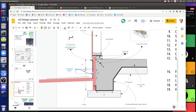We have to dig out a little bit, the easiest way we can, like with a shovel, go take a shovel next to it and dig out without destroying the insulation there. So that's the detail there. This goes all around the foundation, and then we can put the sideways-going insulation, put the tar paper or polyethylene on top of that, and bury that with soil so we can walk on it. So take the shovels out there.